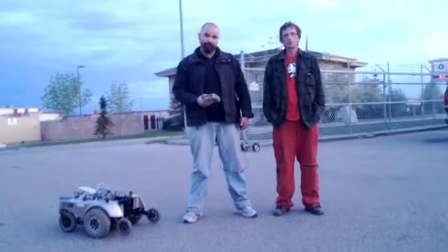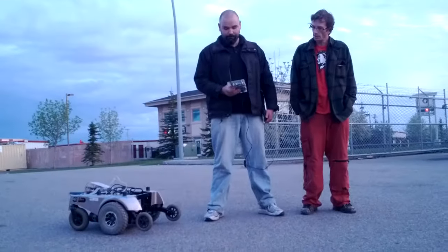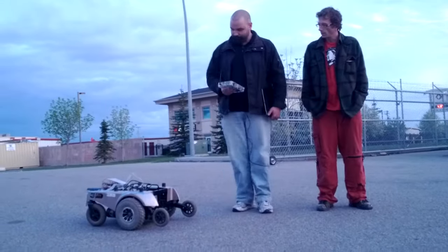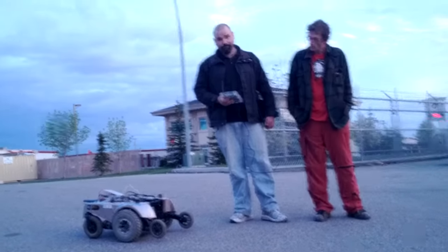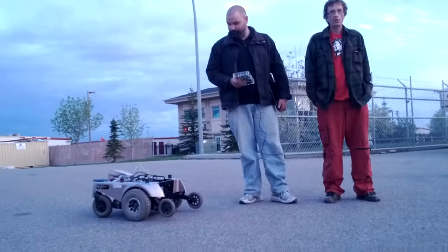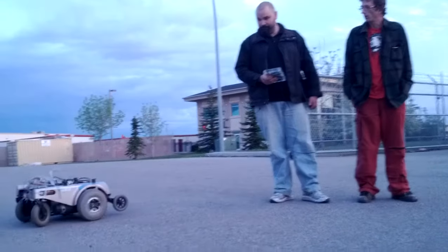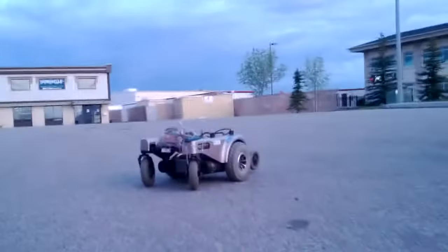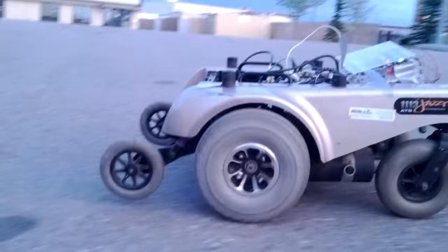We're working on the Scoperta open source robotics platform. We've got our first live test with a chassis on motors under load, and it seems to be working very well electrically, very well mechanically. None of the tests that we've done have caused any sort of increase to the heat sinks on our new H bridges, and our receiver and synapse radio and blue logic board are all working.